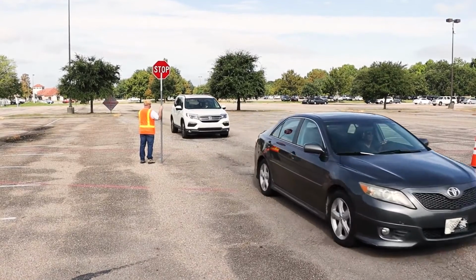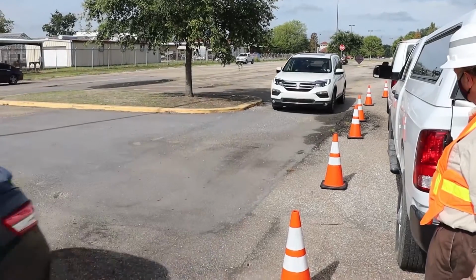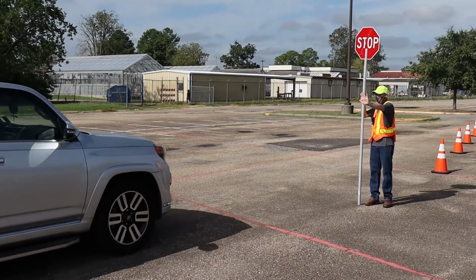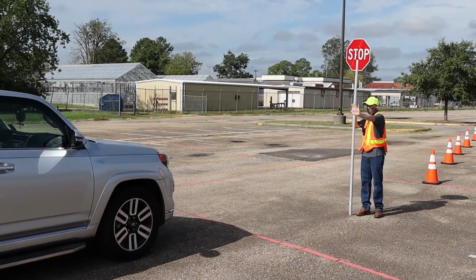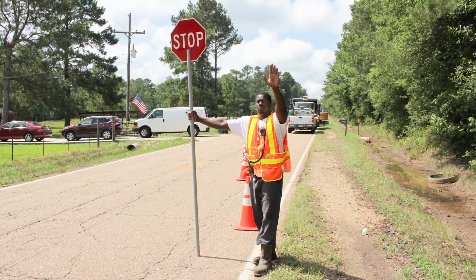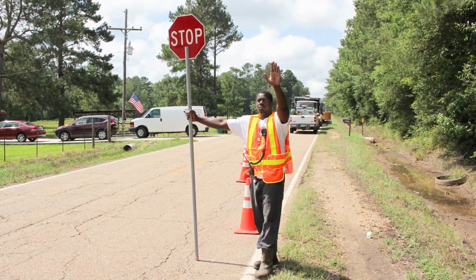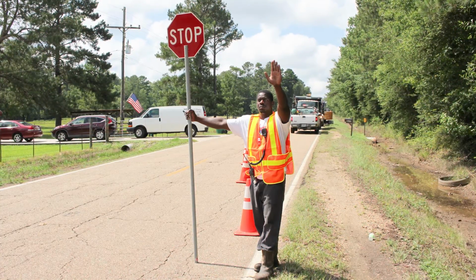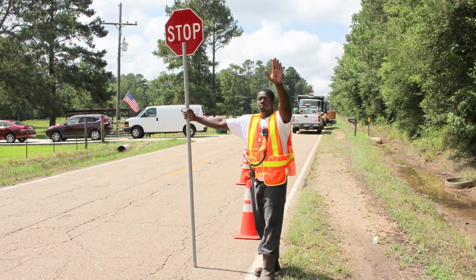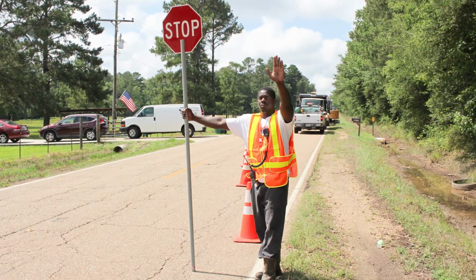The flaggers begin directing traffic in turn. The flagger controlling the closed lane is usually in charge, determining who goes first. To stop traffic, hold the stop paddle sign with your right hand, erect and away from your body. Look directly at the approaching driver. With your free arm upraised in the halt position, bring the first approaching vehicle to a full stop. Do not wave the paddle. Never stand in the path of an approaching vehicle and never turn your back on traffic. Also, since a motorist requires considerable time to see and understand your signals, make clear and precise movements.